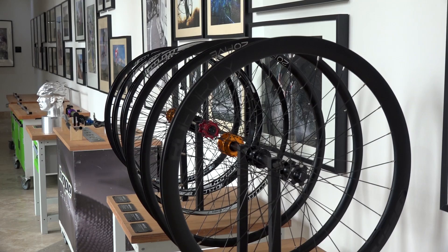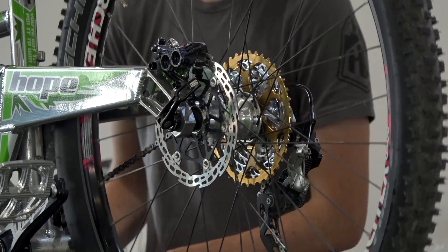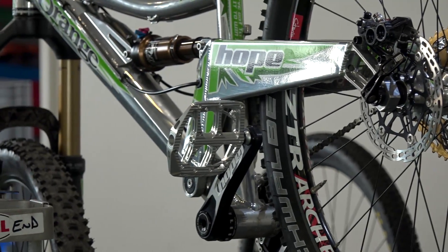And when you're moving from point to point on a part, they're doing contour machining — 3D machining on this — and obviously that all helps when you've got a faster machine. What about the accuracy? This is one of the most critical components they're manufacturing here at Hope Technology. What tolerances are they holding, and what kind of repeatability are they getting? We're talking about five microns repeatability on this. I question whether that's necessary just for a bike part, but if you make a part to a tight tolerance — when you're talking about the seals within it, two components going together — you're going to get much better longevity out of that part on your bike than if it was loosely toleranced. And this machine is coping with that fantastically.